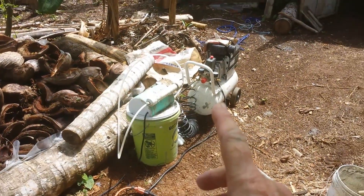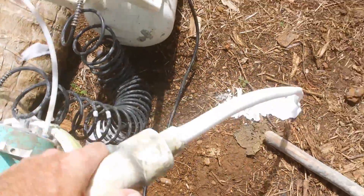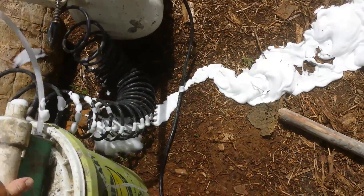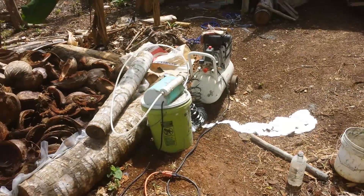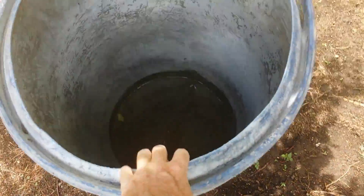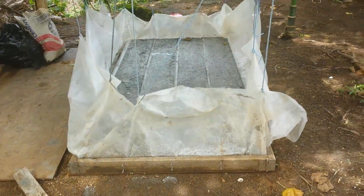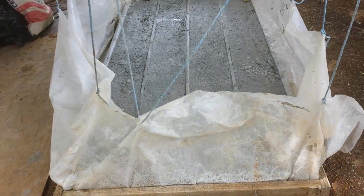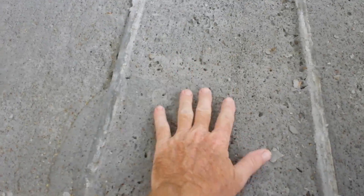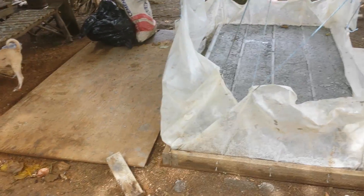We have our foam generator and our little air tank there. This thing still works pretty good — turn it on and we get lots and lots of foam, just like a shaving cream as we're mixing it. Our electric mixer has died on us, so it's very difficult to mix a huge drum full of cement and aircrete. So what we're doing is one of these setups every day. One setup gets us roughly 32 blocks to use up on the dome. The other mixer we're not using because it's too difficult for the mixing.